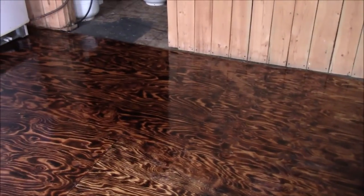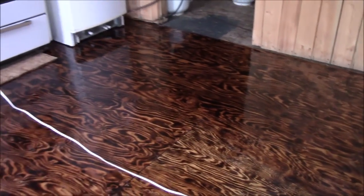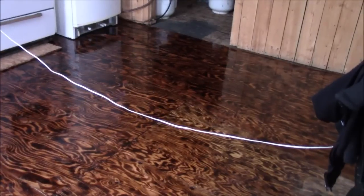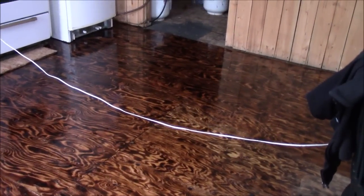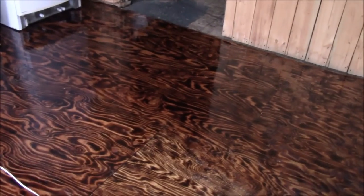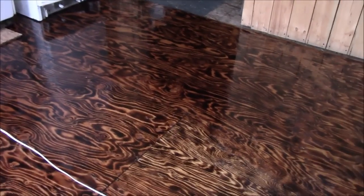I like it. We will let that dry, we will sand that, and we will put on about 5 or 6 coats. It should stay looking really wet like that when it is done. And if it scratches, well no big deal - we will just sand it down a year or two and do it again. No big deal.